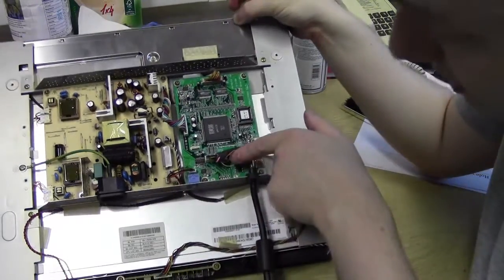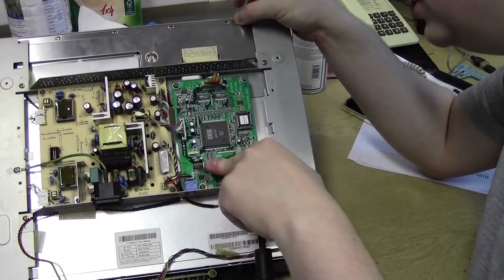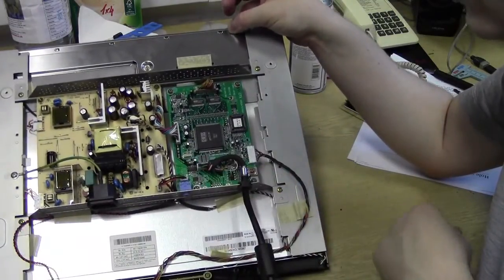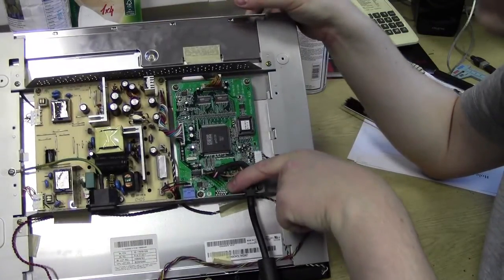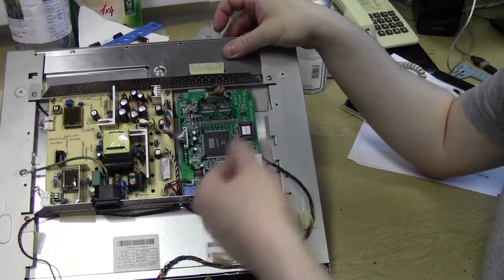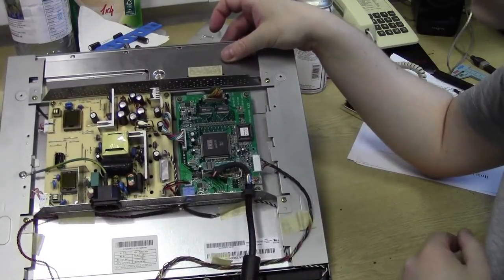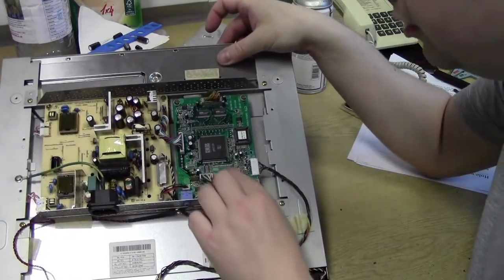we've got some cables here going back to a VGA socket here on this connector. If you wanted to do a hack and there was something wrong with this cable, what you could actually do is take a right angled 15-way high density, solder it straight in, and then you could chop out a hole. You can put in a mount, mount 15-way high density, just plug it straight in. So if there was anything wrong with this, you could plug it straight in. Not a problem.